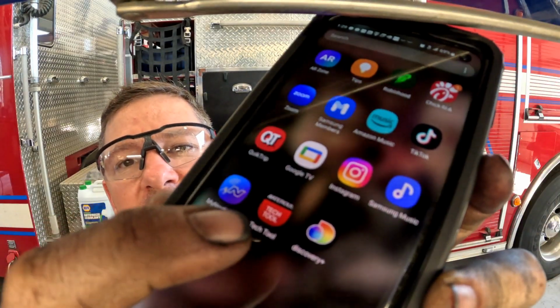All right, so that's basically it, guys. Again, I was using this Waterous Tech Tool app to calculate the smooth bore. It's free. You just go on the Apple Store or Google Play and download it. So we were calculating for 50 gallons per minute and then 300 gallons per minute. Make sure you've got a full water tank, because once you get it up to 300 gallons per minute, you go through some water pretty quick.